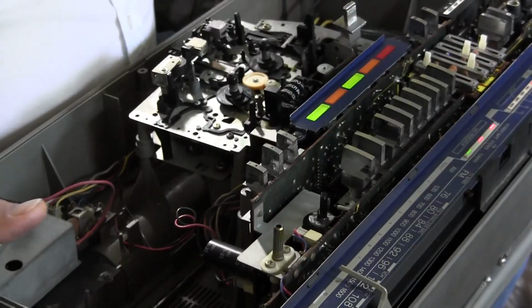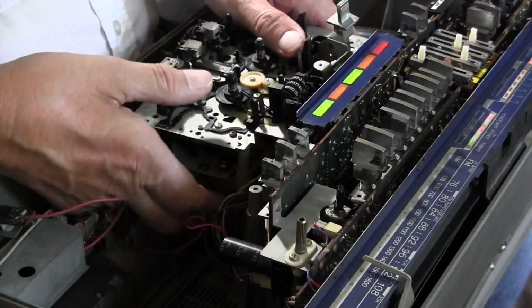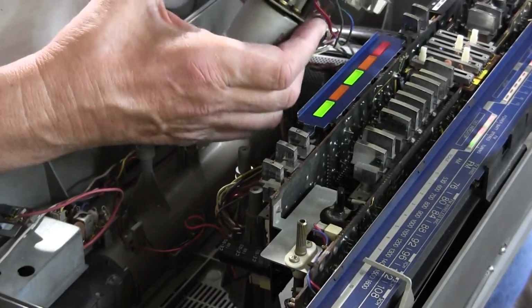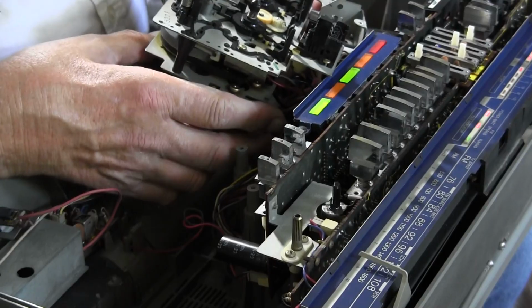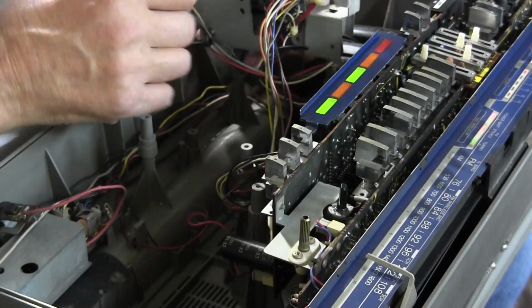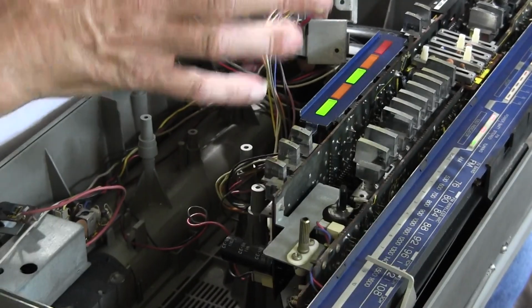Anyway, just wanted to show you that the radio works. I put a new belt. It takes one flat belt. The flat belt goes here, goes around the flywheel. It's 5 screws. There's the belt if you can see it. See, yeah, I'm trying to manipulate 2 cameras. All right, just one tiny little screw here and 4 or 5 screws around the thing, and everything comes off.